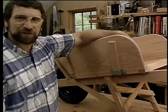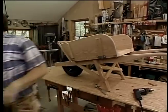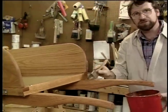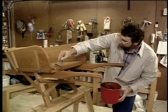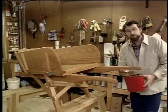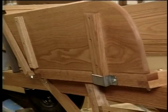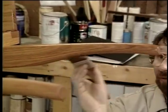What do you think we should use for a finish on this? Oak outside — guess I better think about that for a while. It took me a long time to decide what to finish our old-fashioned wheelbarrow with. I was afraid that if I used a urethane or a varnish, it would chip after a while and then the wood would be exposed to moisture — same thing would happen with paint. But I did recall years ago a method of preserving wooden ladders, and that was to put on coats of boiled linseed oil. So what I'm doing here is putting on a couple of coats now, and then I'll put a coat on every year or so as needed. But you have to make sure to use the boiled oil, otherwise it will never dry.